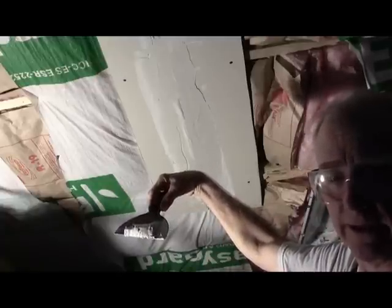All right, our first run. There again, wipe off the edges. Hopefully you can see how I've wiped off the edges. I've got about 4 inches of mud on there from side to side with the edges, because what happens, if you get it over the edge, it just drips off and makes a big mess on your floor. This way it's a little cleaner. Takes a little longer, but for homeowners, this is the easiest way.